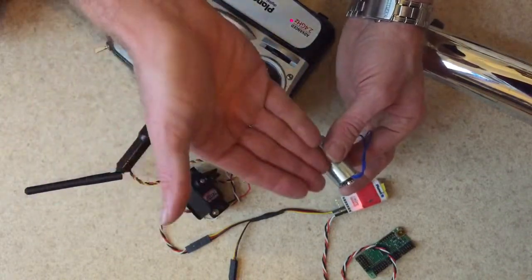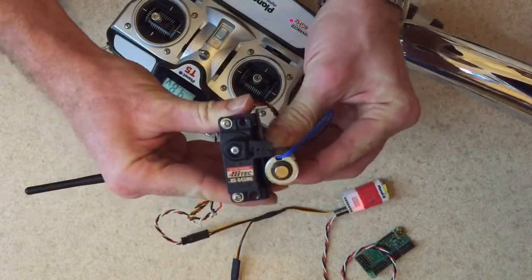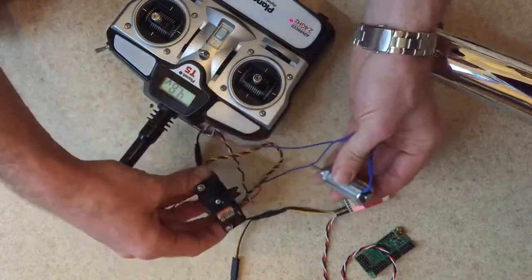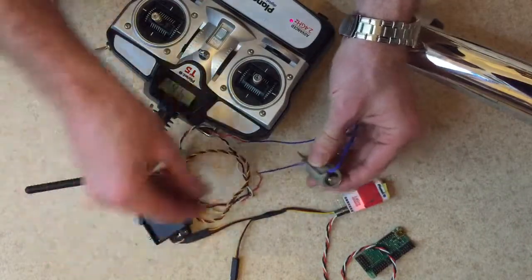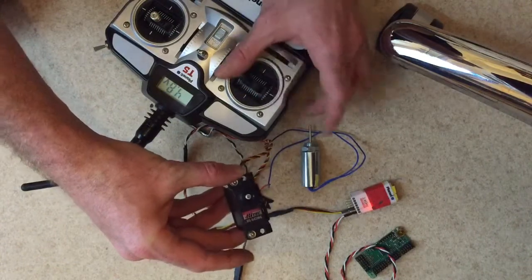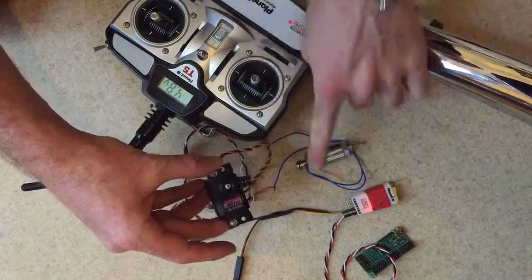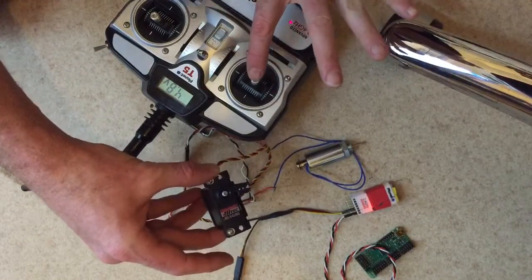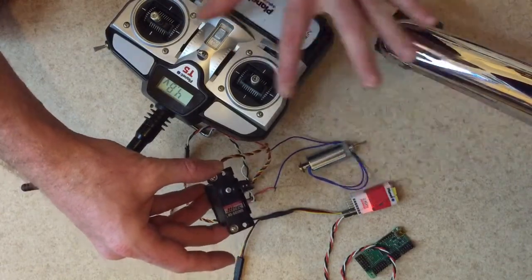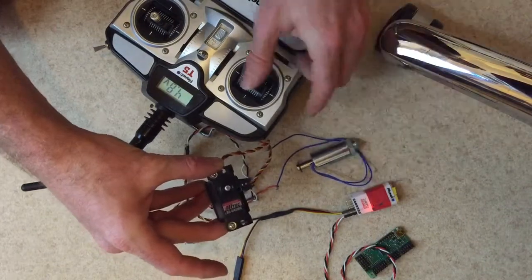So when I have a robot with lots of pairs of solenoids and servos in every pan or tilt segment, I need them to behave themselves. At the moment, if I move this, you can see that the servo is activated, and the brake's already engaged because it sort of plays up. It doesn't have a spring on it yet, but just imagine there is one. If I move that, you can see it moves very quickly. But what's also problematic is that if I move it slowly, it takes a while to engage.